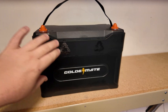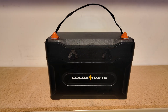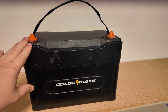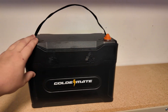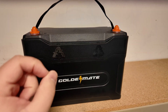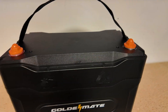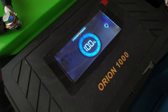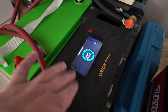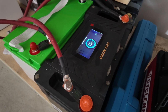You really won't be disappointed with GoldenMate. As you saw from the tests, they've really got it dialed in — especially the BMS. It can give you the surge load that you need, but it also has very good tolerances for overcurrent protection, ensuring you're not causing a risk by drawing too much current on your cables. The low temperature charging protection works super well — one of the fastest triggers I've ever seen. I also like that they use cylindrical cells; the product is a little heavier, but if one cell were to get damaged, it's only a small cylindrical cell venting rather than one of those giant prismatic cells. I love the app control. The only thing that would make this even better is a screen — but if you want that, get the Orion 1000 model, which has a huge gorgeous screen, integrated handles, and a beefier BMS rated up to 150 amps continuous discharge. But this is definitely my favorite 12V 100Ah battery I've ever tested.